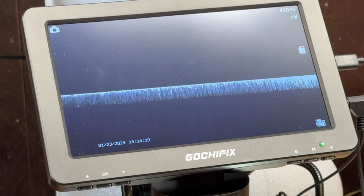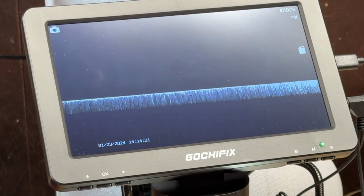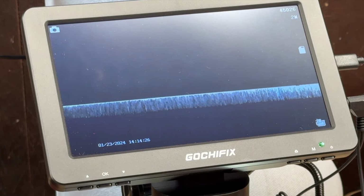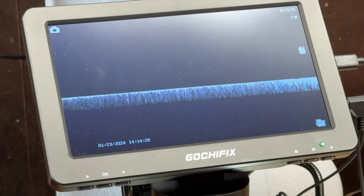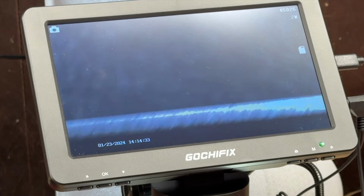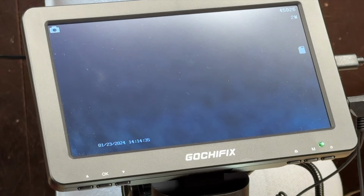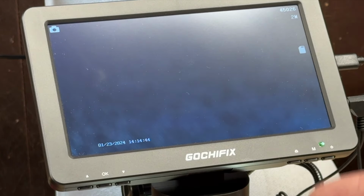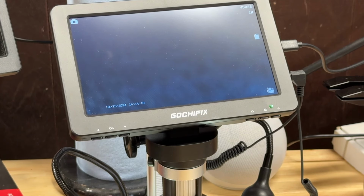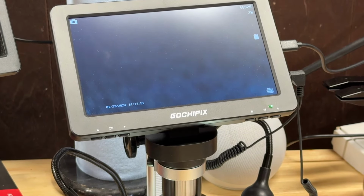And I just wanted to kind of clarify that, because I think so many people don't clearly understand and grasp that it is not just going up in a high grit progression that makes a knife sharp. It's just angle, proper sharpening, and proper burr removal. You can make an incredibly sharp knife, even if you only had one belt, as you saw here with a 200 grit belt. So hope you guys enjoy that. Just a quick little information and tip out there for you all to see.